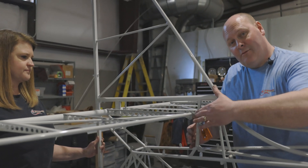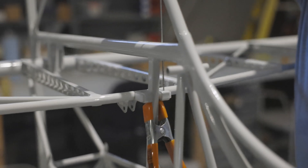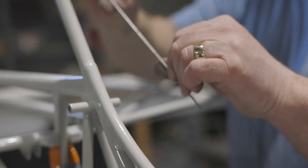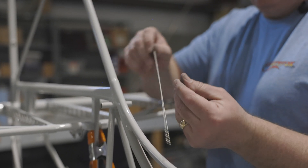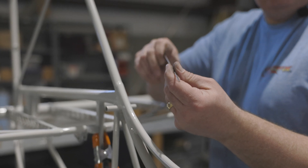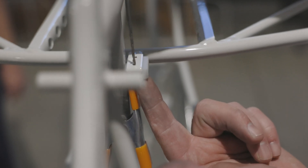Earlier in this segment, you heard me talk about using a 40 drill bit to pilot these holes. We want to use the pilot holes we drilled and now match them with this number 40 drill — this is a long 40. The nice part about the long bits is they'll bend and move so you can access things quite easily without permanently bending the bit. We're going to come in here and drill straight down through the plastic, and then ultimately put our final hole through the steel.